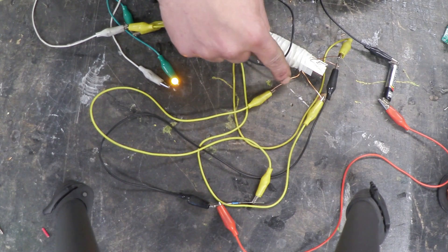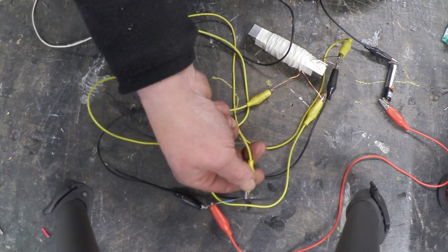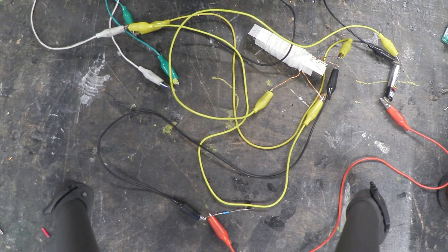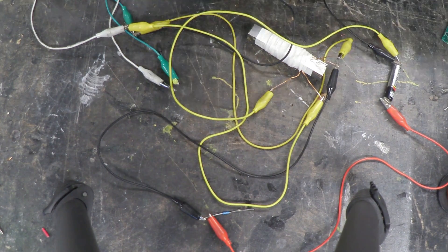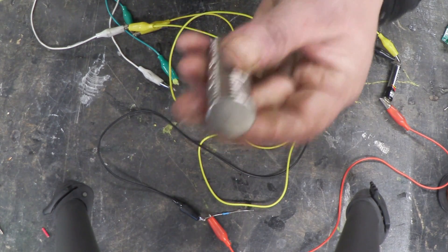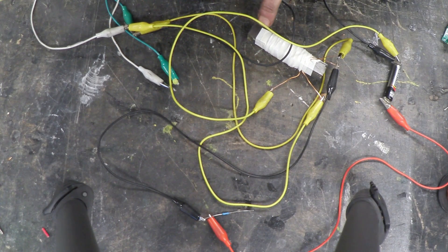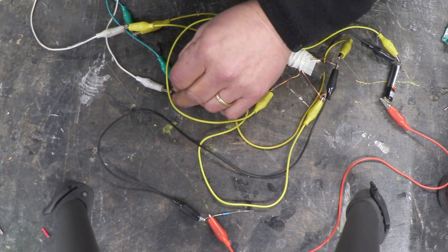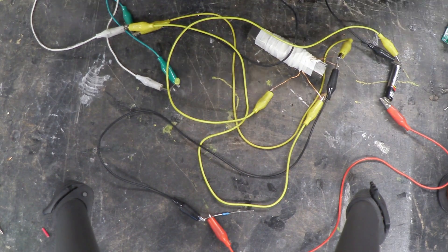There's the battery. This wire comes from this coil here, so if I disconnect it that lamp will go out — there we go. Now if I just put that on the negative of the battery we have in fact formed the SSG circuit, or at least that's what I'm saying. Now in order to see if that's right I've got a bunch of magnets here, and I'm going to approach this coil with them and we should see that LED flash as it's triggered.